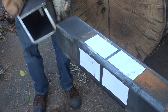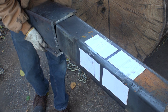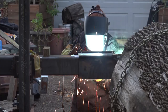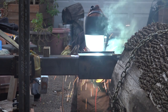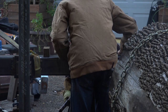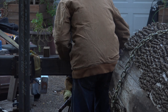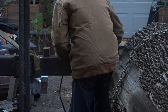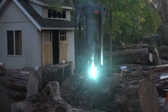That is impressive. That one already hit this one. So see how it goes in. How do I prevent that? Just pause. When you're about to be done, pause in that spot for a little extra longer, and then come off and pull straight this way. I usually come back over the puddle. Oh, okay. So you pause, come back, and then out? Mm-hmm. Yeah.